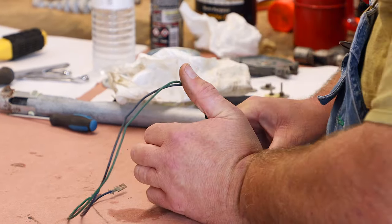Now we'll use some white grease. And we'll get in here and just kind of get some onto that gear. Put this felt washer in. Soak a little oil into it. Now these pins can give trouble because you'll get a little oil or grease around them, and they'll make like hydrostatic lock, and they won't want to press in all the way. So try to keep excess grease out of these holes and make reassembly a lot easier.